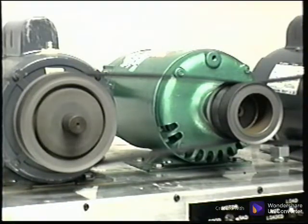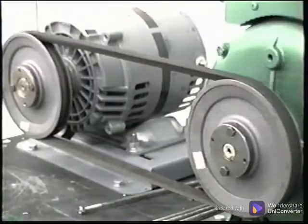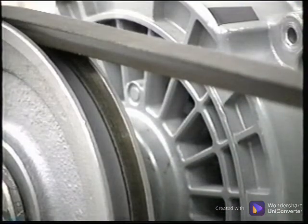Belts are commonly used in most manufacturing facilities, but can generate excessive vibration when they are carried on eccentric or misaligned sheaves. Since belts rely on friction to work, they will generate some amount of heat. However, misaligned sheaves cause the belts to ride up on one side, causing more heat on that side of the V-groove. The thermal image will indicate this misaligned condition.